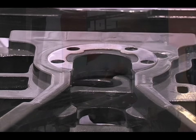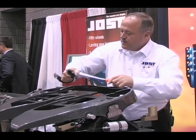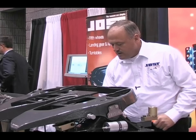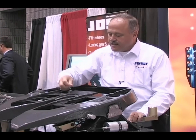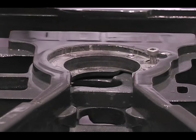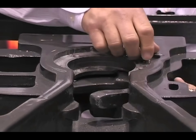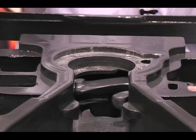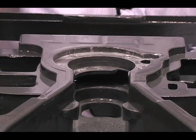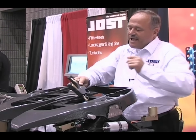Take a screwdriver, pop the collar out. Take one of the bolts out of the top and remove the pivot pin. Reach under it so you can get it, and the lock comes out in your hand. The lock itself has a grease line on it — you can grease right into the throat, and that will make it last indefinitely.